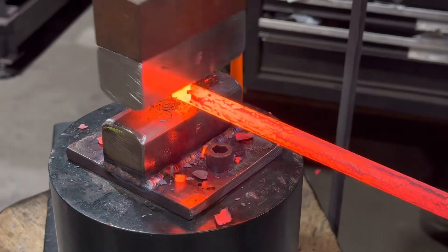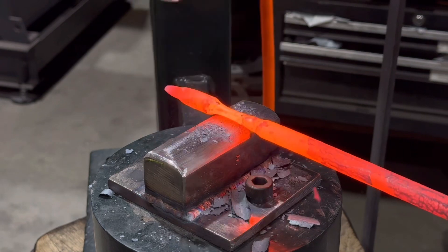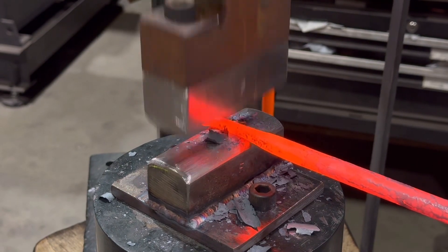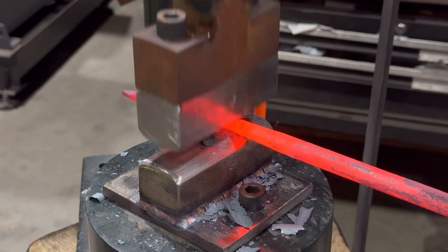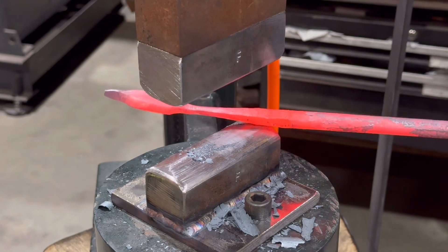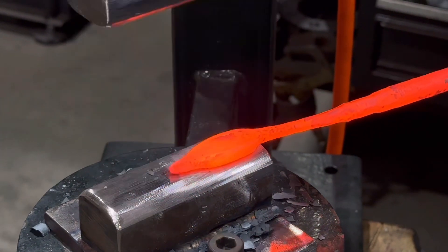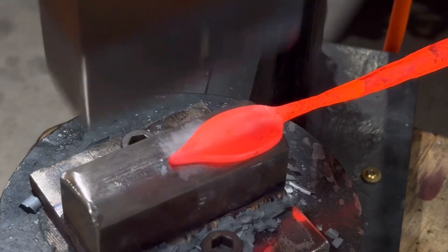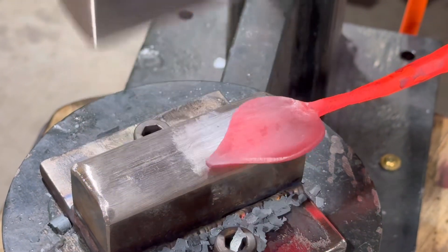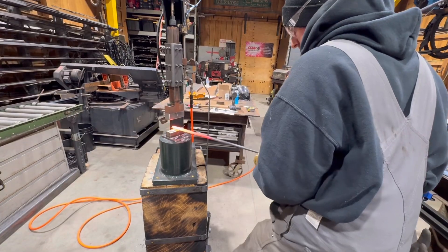Here are the drawing dies — I'm going to forge a leaf. I was so impressed with how fast it did this. Using the dies to put a taper on, and because it hits so fast, instead of squaring it off like you normally would I just rolled it to forge it into a round, which worked really well. I did square it off in the back to forge out the leaf stem taper. Then I started the flat, and on the next heat you can really pull it flat — because it hits so fast, this is like the perfect operation for this type of hammer.